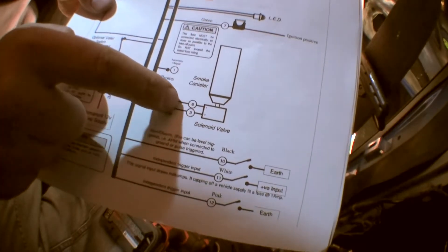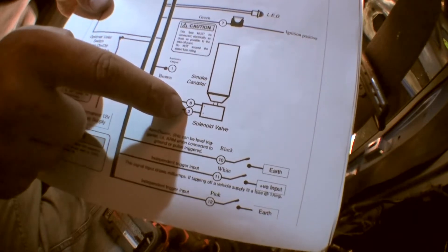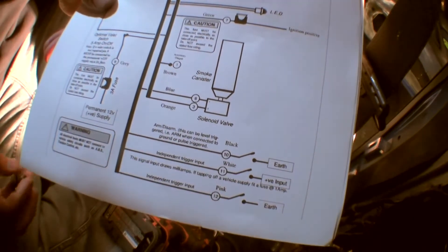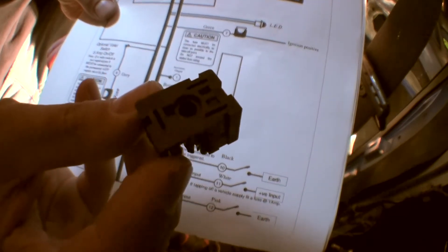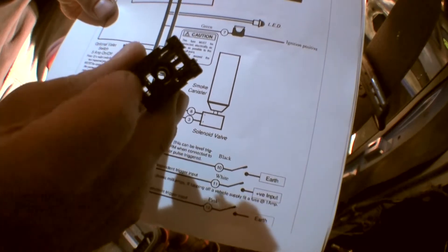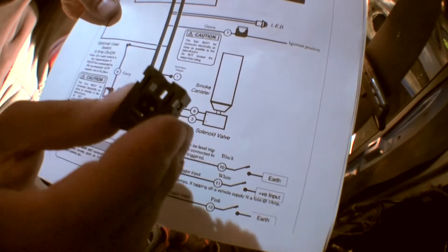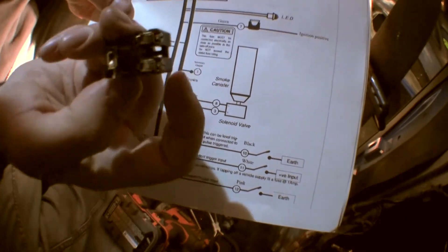On this diagram you can see they want wire number 8 and wire number 3 to go to pins 1 and 2 on the solenoid valve. There's 1 and 2 labeled, and then this one's going to be ground. I want to make sure I'm connecting the right leads so that once the relay is plugged in, it's going to the right leads.